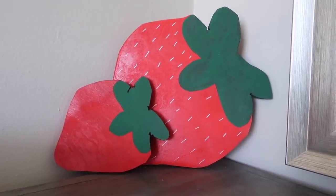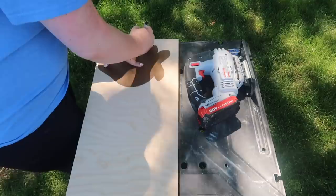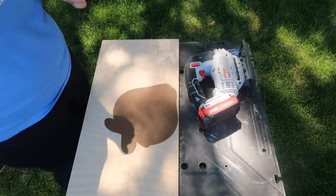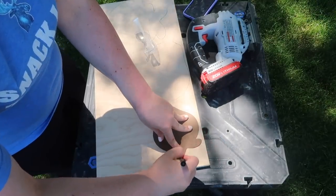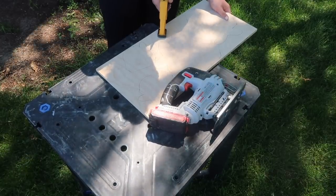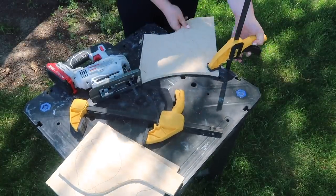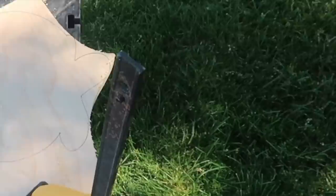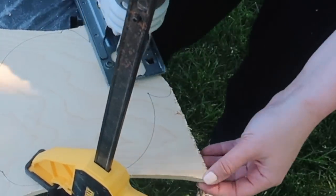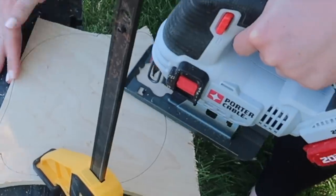Up next are these wood strawberries — I absolutely love these and I'm getting a lot better with my jigsaw. I took some of my larger stencils from those fabric strawberries and traced them onto a scrap piece of birch plywood left over from a recent wood sign project. I did two of the large ones and two of the next size smaller. Then I made sure to grab my safety goggles — make sure you wear these when sanding and cutting with a jigsaw because pieces fly everywhere. I cut off each piece individually and for tighter areas, I would cut a little bit inward, cut about half of it, cut down the center, and then cut the opposite direction.